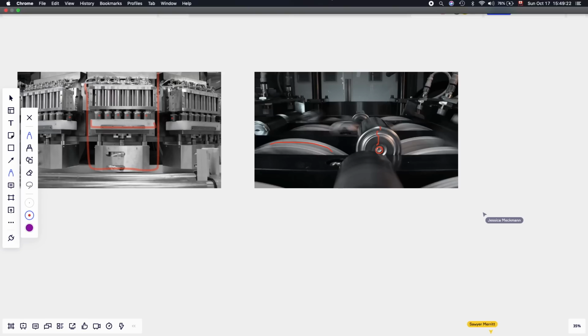Like if you had a little defect in your electrode belt, like for the dry battery electrode process, if you had a defect, the only way to detect it efficiently is to make the cell, charge and discharge it, age it, and then you measure. And if it's nominal, it passes. If it's not, it's rejected. And this is where you get yield, of course, at the end of the whole process. How many batteries are coming out of this process? Good.